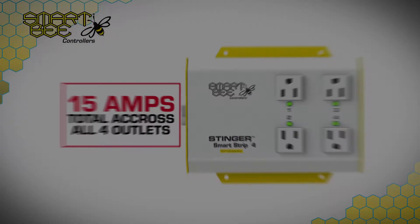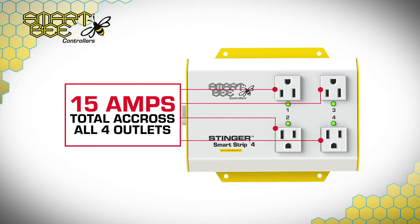In the event of an overload, each circuit has an auto shutoff, which will attempt to disable the circuit when the average current is outside of the device's specifications. The Smart Plug and SS4 will attempt to shut the device down, send you an email notification of the action, and allow you those precious extra minutes to respond immediately and diagnose any problems within your facility. With active power consumption monitoring, the SS4 allows a total of 15 amps across all four outlets, so the current monitoring ensures you're not overloading the device.